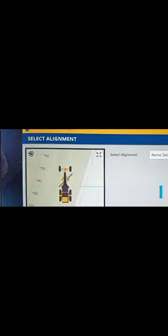You can press and hold any one of those lines and it'll really light up red. Basically, you've got your two buttons that operate your two rams for your automatics, and then you've got the other button which is your side shift. It keeps your board side-shifted and stays on-line as long as you don't run out of ram and you steer the machine pretty straight — it'll do it all for you. This is how you choose a line in order for that button to work.